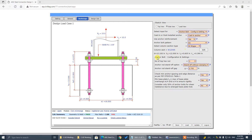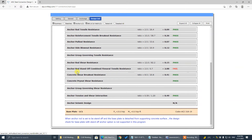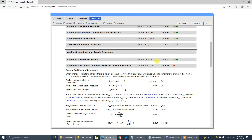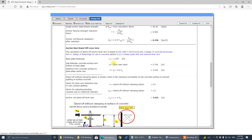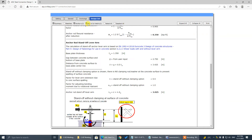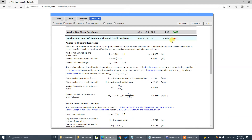But there's some disadvantage: the base plate is not touching the concrete, so there's sticking up — there's an overhang or cantilever of the bolt. There will be one additional check under the shear section. There will be an additional check like this: a check on the bending of the anchor bolt. That normally governs the design. For standoff options, most of the time you fail at this limit state check.